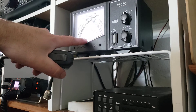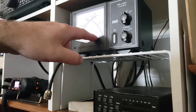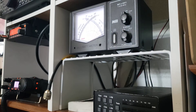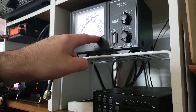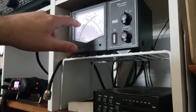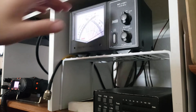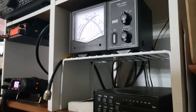What we're going to watch are these two needles here. There are red lines — one is way down here, then it goes up, and two is about there. The red lines are our SWR, our standing wave ratio. I basically want the cross where these two lines cross to be as close to one as I can. This needle over here is going to be our forward power, and this needle is going to be our reflected power. You can see I'm about 1.8, so about 1 to 1.8.